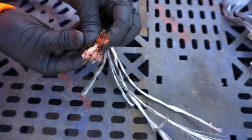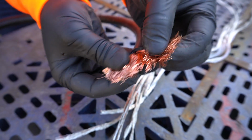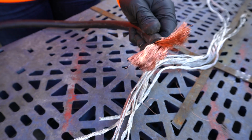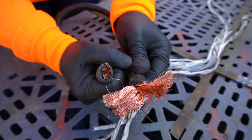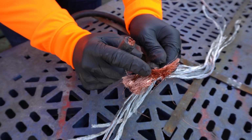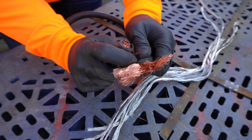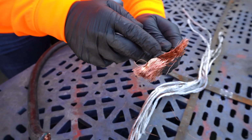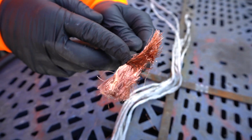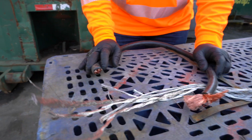Generally in welding cable you're going to see lots and lots of ends, as opposed to an electrical cable. You're going to see 300, 100, 200, 500 little strands of copper going throughout that you can see on the other side. What's nice about welding cable is it's softer, and that's because there are so many strands, and it generally is much easier to strip. This jacket on the outside, if you have a wire stripper, will go through in one shot and peel away. If you took a knife, it would slice just as easily, of course, with gloves on.